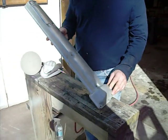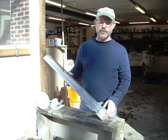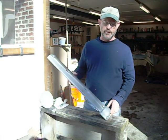Glass beads are a little more uniform and they give you a better appearance. Bead blasting, walnut shells, soda — all those processes are good for cleaning parts up, but they will not give you a good shine.